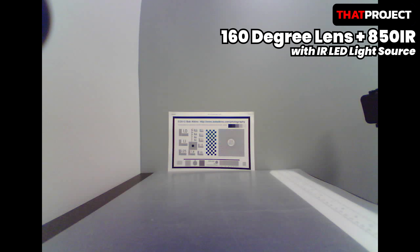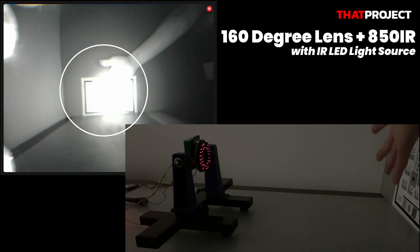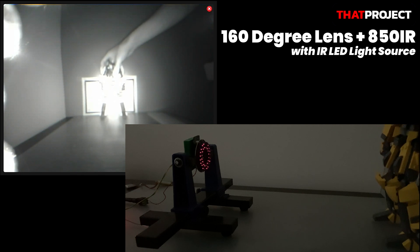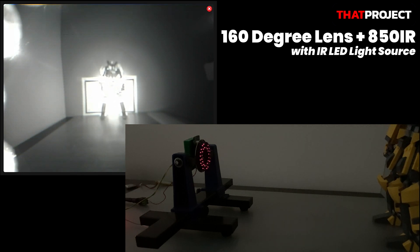Finally, today's hero — the 160-degree wide-angle lens with an 850nm IR layer. In the bright place, it looks the same as the previous 160-degree wide-angle lens. Wow, it's showing up very differently from the previous lenses. But it's a problem because it's too bright now. Currently, the distance between the light source and the wall is short, so the center is very bright. Nevertheless, you can see much more than with the previous lens from the indirect light source in the periphery. In order to use this light source properly, it's necessary to keep a certain distance from the subject. This lens can properly absorb IR light, so you can see a much better image even in a darker environment.